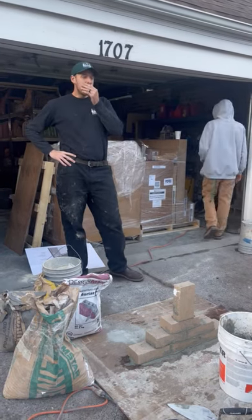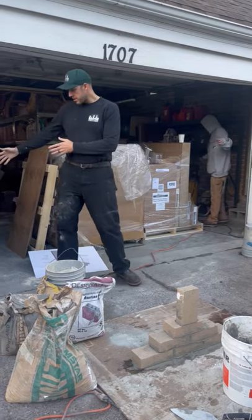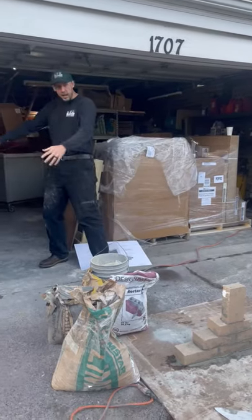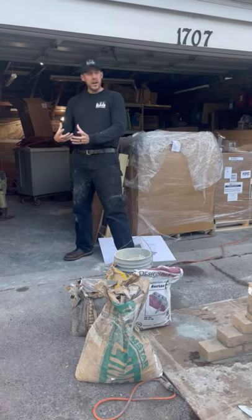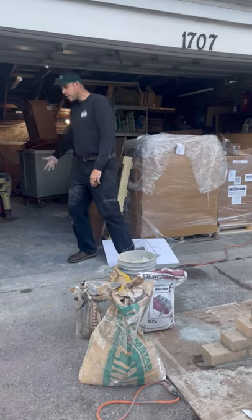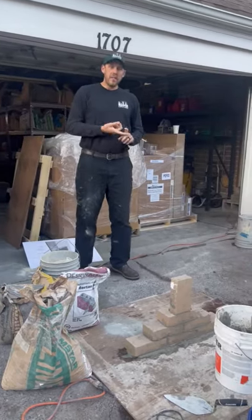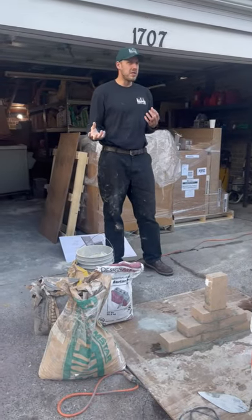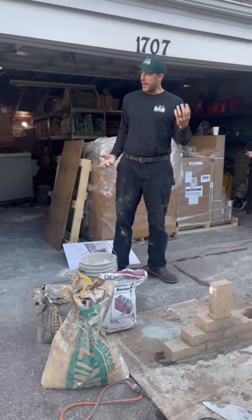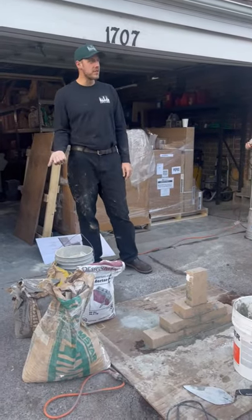Exactly. So a lot of times in those settings, you'll see the fireplace room, and then just down the hallway or off to the kitchen in the floor, you'll see this big air return for the furnace. It is basically sucking all the air in that living space down into the furnace and then pushing it back through the vents. So you've got to turn off the furnace whenever you light your fire, because what you're experiencing is two combustion systems fighting for oxygen. You've got to turn one off before the other one can start up.